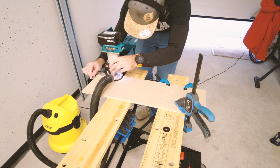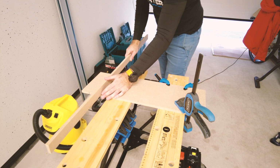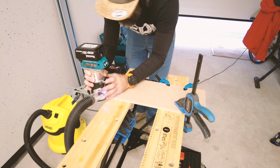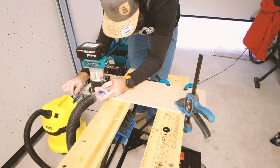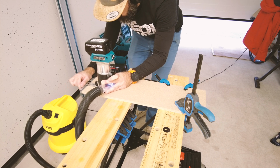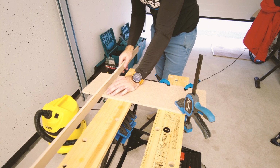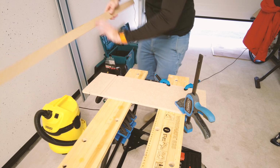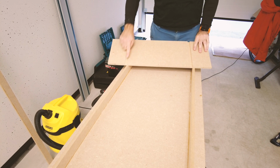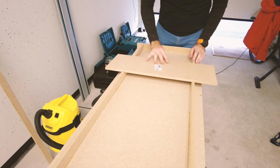The first cut was a bit too tight, so I had to do a second pass after a quick test, just to make sure that the guide will fit snugly but loosely into the channel. And that's just a perfect fit. Once I had cut both channels, I did a fit with my tray to make sure that my sled would slide smoothly through the entire length.